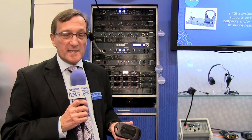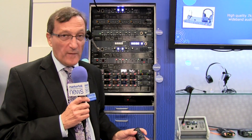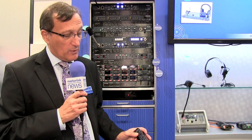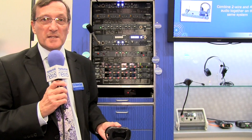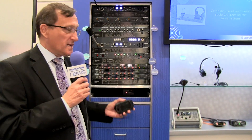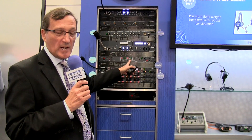What's new about this is it's working at 7kHz audio, so high audio quality. We've simplified the controls with two-channel operation, A and B, with an ISO so that you can talk to your wireless colleagues without connecting to the four-wire and two-wire systems that can connect to the base station directly.